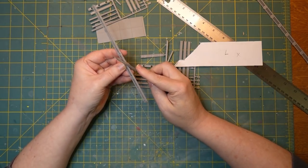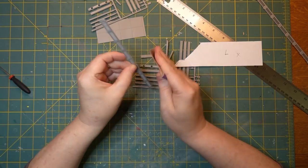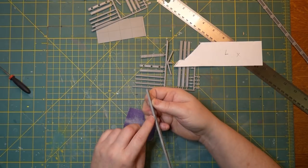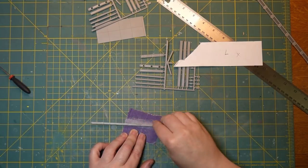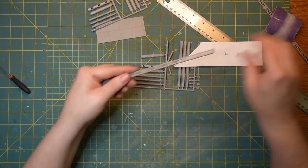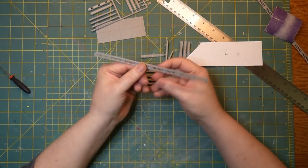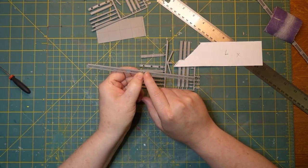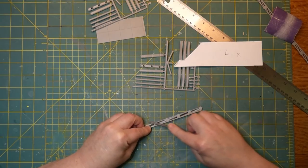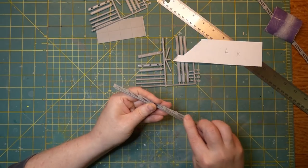That's what I'm gonna take care of right now. I'll get my file — usually I use sandpaper but the file works. We're gonna sand those flash bits right off of there. When I did the railing in front of the train station I went a lot further with finishing than I'm gonna go with this set of railings, only because those are in plain view right up front. Now the bottom is flattened out. We have to handle this joint — I'm going to take my file and go right over this joint on top and on the back side as well.